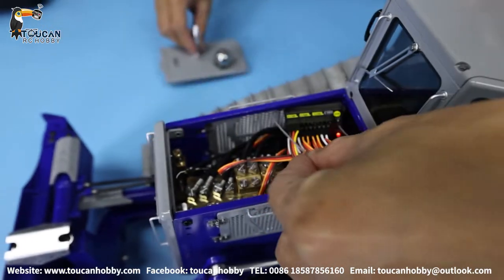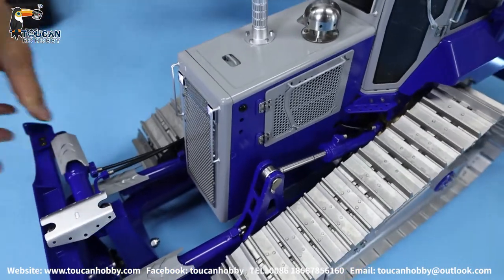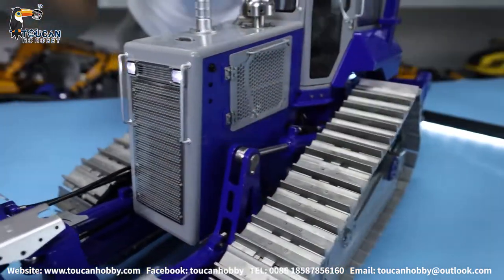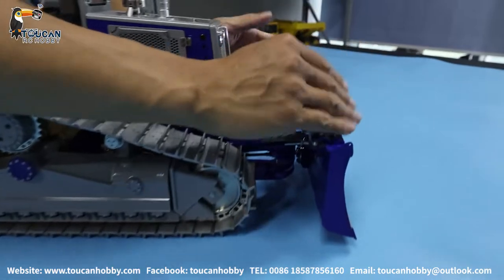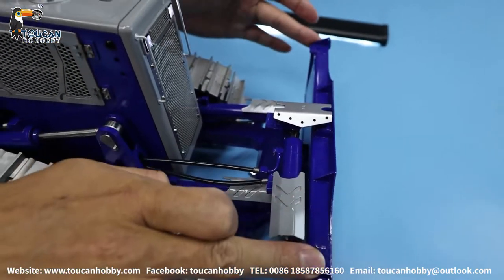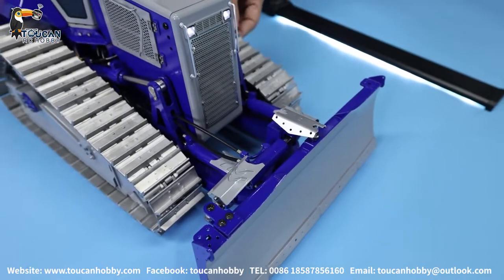We will put it back, pushing wires inside. Lock it. From the front, we see the big arm — it has one cylinder, another cylinder, so two cylinders for controlling the big arm down and up. For the blade, we can turn to the left side and right side, controlled by these two cylinders. And for the lean of this blade — lean to right side and left side — controlled by this cylinder, which pushes going down or this side.